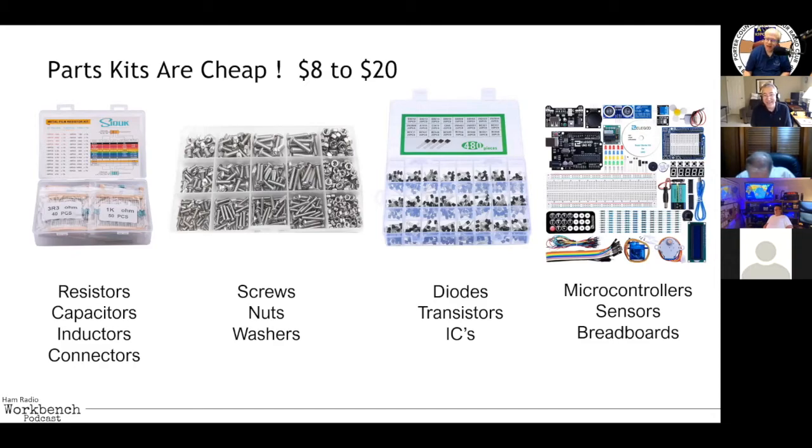Now, what's wrong with that? That's a lot of heat loss. Exactly. That's a lot of heat. That linear regulator is going to drop 7 or 8 volts times the amount of current you're pulling through it, in watts. So if I'm dropping 8 volts and I'm pulling an amp, that thing is going to dissipate 8 watts. That's a lot of heat. Yeah, it is too hot to handle. The most current you can pull through that part and not feel it is about 100 milliamps, even though those are 1 to 2 amp parts.